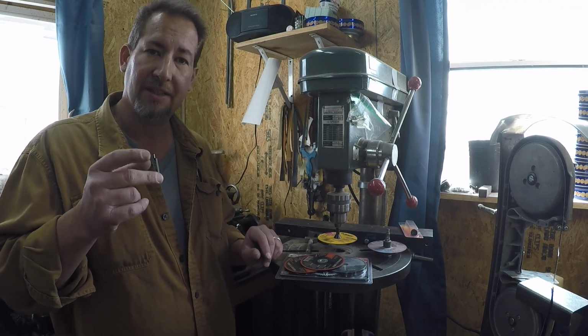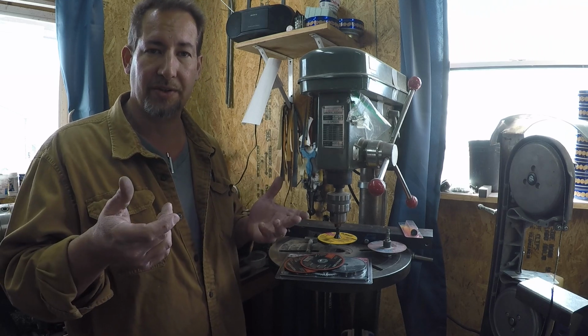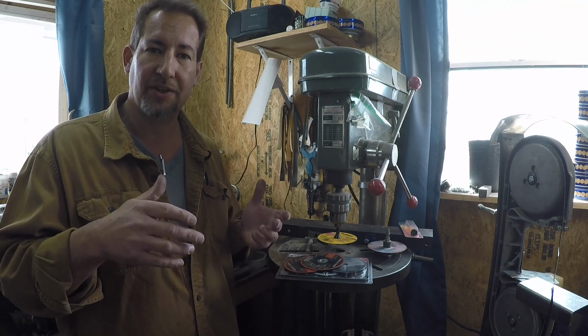The second problem is that when I was cutting in nail nicks with a 60-degree milling cutter, I was having a hard time. I was getting cracks. Anytime you have sharp corners on a blade and you heat it up and you quench it, they can be stress risers, and so you can get cracks that start at sharp corners. So knives that go into heat treat with sharp corners are not as good as knives that go into heat treat with no sharp corners.